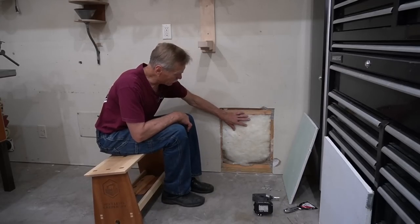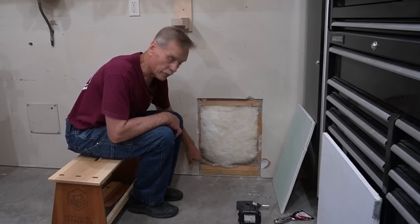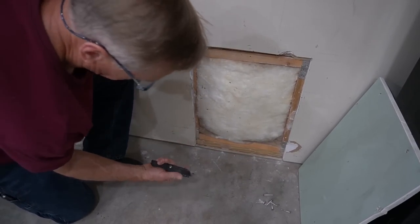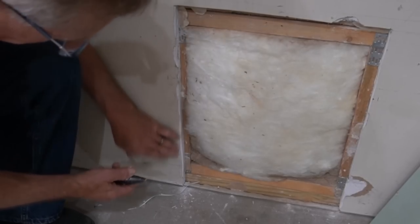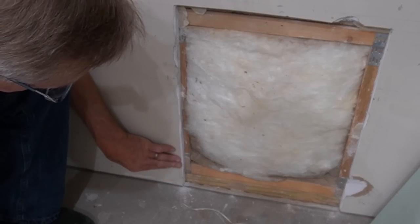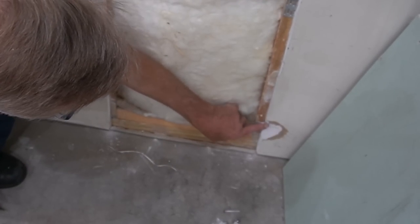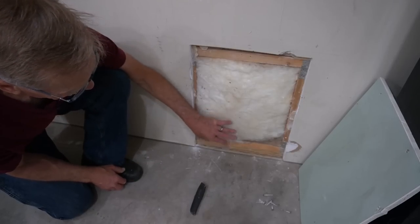With that temporary patch removed, you can see this is a floor truss. When I cut the hole out, I was careful to cut through the center of the framing members so I'd have wood there for driving screws to hold the patch in place. If you look close, you can see the edges are pretty clean, and I've beveled away the paper using a sheetrock knife. With a sharp blade you can just trim off that little fuzzy edge of paper, which makes your patch a lot better because you're not taping over irregular edges.